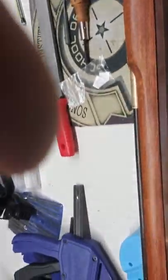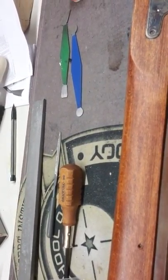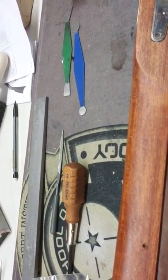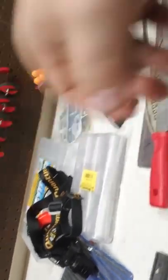Following that, I did drill for the nose cap, making sure all the pieces stayed nice and tight. The final step was fitting my sights, making sure they lined up — taking off just enough metal to get them into the dovetail, making sure they were in there nice and tight, and drifting them in with a rawhide hammer and a punch.